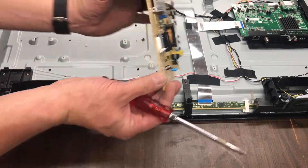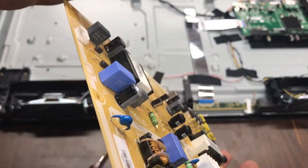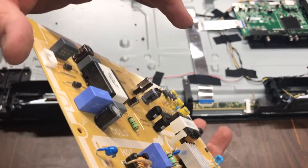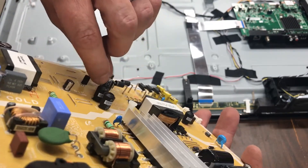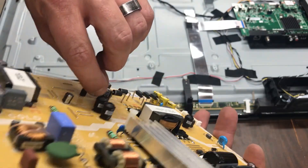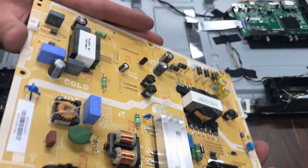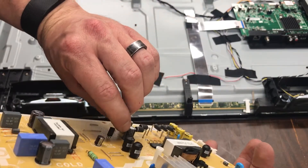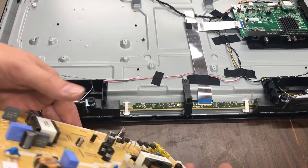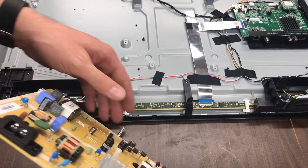Now, in order to find out exactly what capacitor to buy, you'll look along the side if you are trying to replace the capacitor. I don't recommend this unless you've got some sort of soldering experience — some sort of experience with electronics. You'll look on the side and find the voltage and the capacitance, measured in microfarads. Your microfarad measurement has to match up, and the voltage you want to be at least that, if not more. Don't go crazy with it — don't go 30 volts if it says 12.